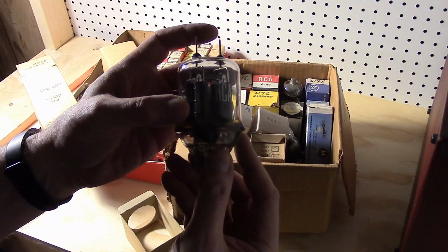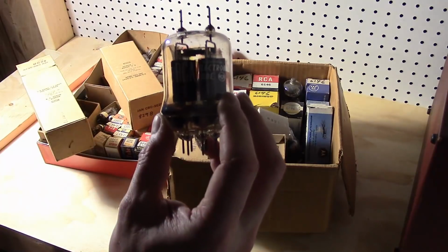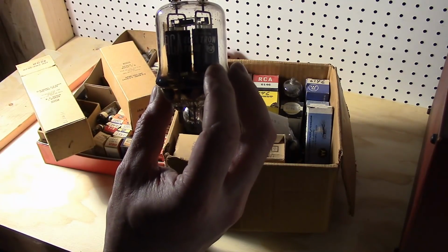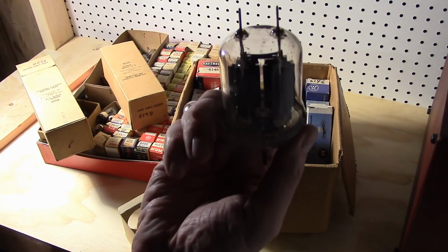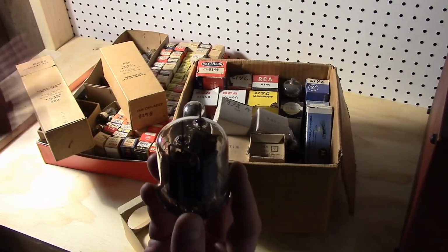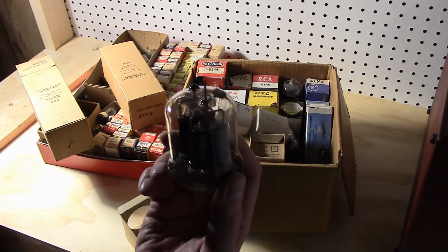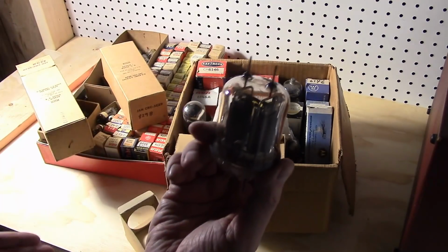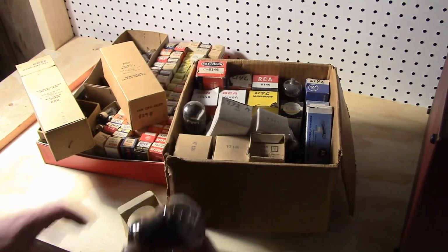5648, I believe that'll be the 48th week of 1956, because it couldn't be the 56th week of 1948. So twin triodes, meant for VHF operation. I don't know the exact frequency range, but let's say some tens of megahertz probably. Not a ton of power, maybe 5 watts per triode, something like that.